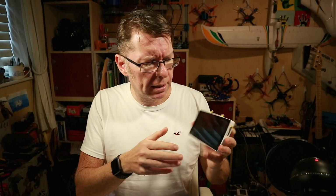But the other thing that was kind of interesting about that is the DVR recording actually cut off about 30 seconds before it crashed, and nothing happened to the battery. That stayed in okay. I expected to lose the signal when it went down there, and thus the DVR would stop recording, but it stopped a bit earlier. And I was thinking about this, and aside from that dodgy cable, when I got back and tested the cable out, I plugged the cable in here and tried it on another device, and it was still failing. Then I tried a good cable and that was fine.